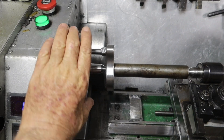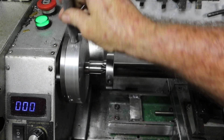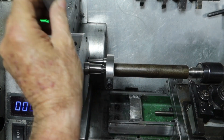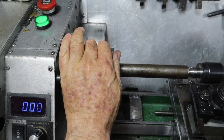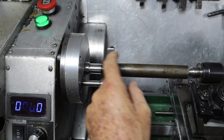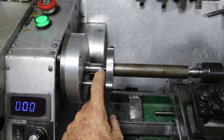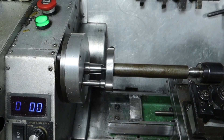While you guys weren't looking I fitted all this back up and machined up a little bar to put in that hole you saw me drilling in the side, so I can hold it while I tighten the nut up over the back of the spindle. I'll also be able to use that in my collet chuck when I'm trying to thread. I also faced the ends of this bit of mystery metal - a bit of scrap binium - and put some centers in it. I have cocked up here slightly - I'm going to have to remachine this and bring it back in about 10 millimeters because it's sticking out way too far, and I did have to cut a little bit off the end.